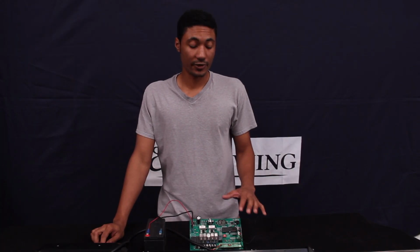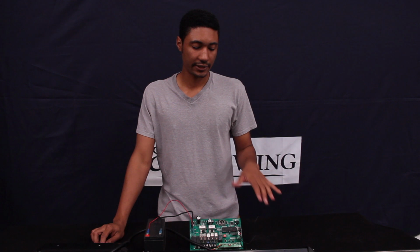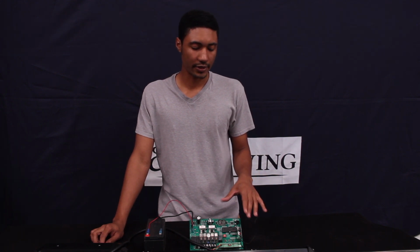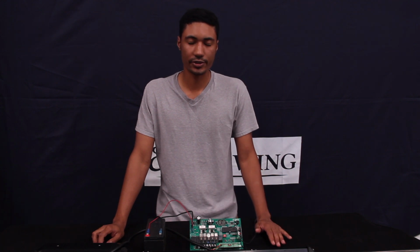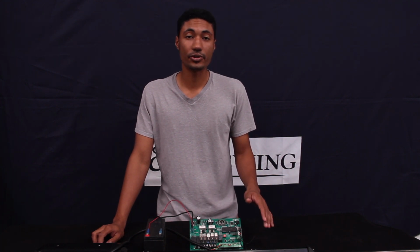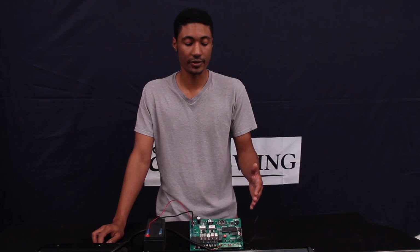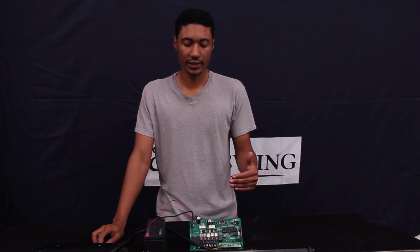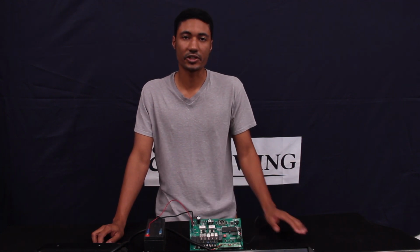So as I mentioned before, this is really easy to do to set these limit switches up once you get that actuator attached to the gate and you got your brackets fully mounted. It just makes it really quick, simple, and easy to get the right open and close position without having to do too much and operate the gate back and forth too many times for the first run. So this way you can really get an idea of how you want to set up your parameters once you get those limit switches set in the right spot.